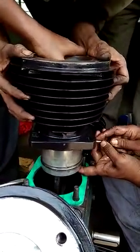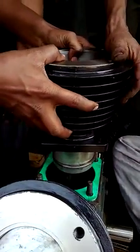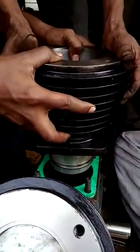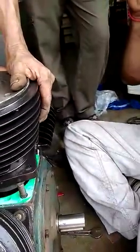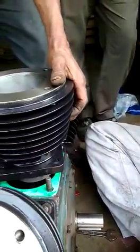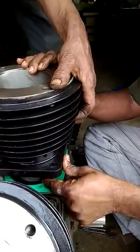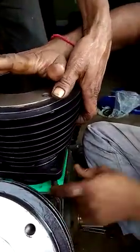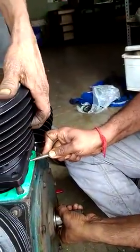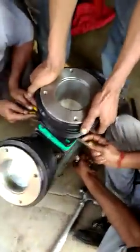In the compressor there is a safety valve — it is required. If the pressure in the tank exceeds 7 bar, the safety valve opens. We can set it as per our requirement, but mostly it is set at 7 to 8 bar. There is also a pressure switch which is used for cut-in and cut-out to maintain pressure.